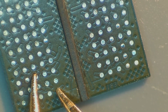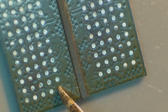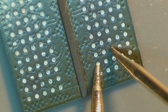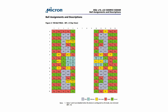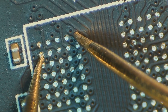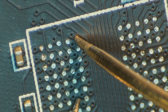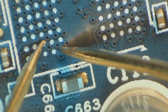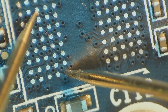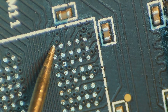I'm not sure if the VRAM chip is dead or not, so I take measurements between the data lines and ground in diode mode using my multimeter. You can easily find the datasheets for your memory chips on the internet. The datasheet tells me that the ground pads are green and the data pads are the blue ones. I'm getting consistent values, meaning that the chip is most likely undamaged. I'm doing the same measurements on the PCB board pads as well, and it's all looking good on both the board and the VRAM chip.